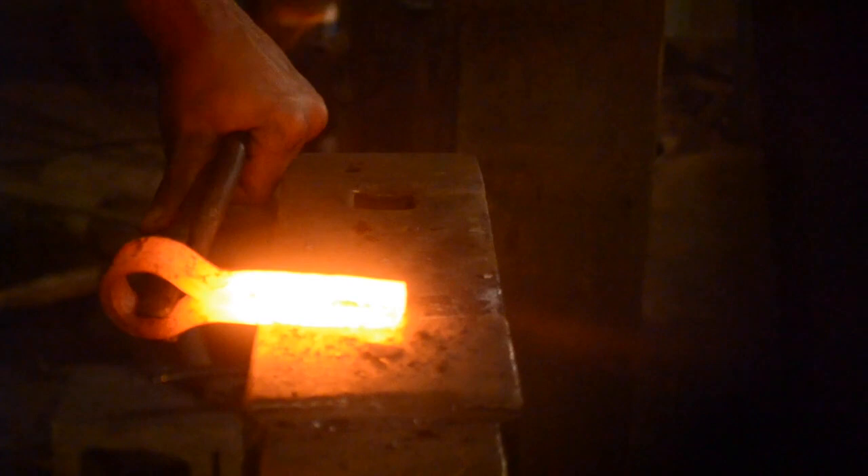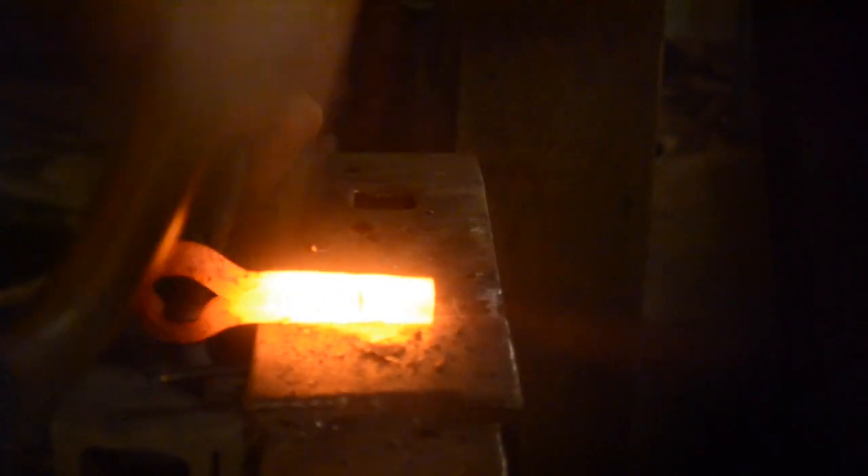Now I'm going to work down the bit into the appropriate shape. Unfortunately I overheated the piece here — this type of spark means the metal is burning. It's not the end of the world but it means your surface isn't going to be quite so nice. I'm forging down the bit at a welding heat. You can improve a successful weld past three heats even if you can't repair a failed weld. You want the hammer to strike diagonally so that the bit gets smeared and elongated — sort of pull with the hammer on one face and push with the hammer on the other face. One of the characteristics of blacksmithing is that you will get burned. Even if you're wearing gloves you still might get burned — the worst burn I ever had was when a glob of liquid borax fell down the back of my glove and I couldn't get it out. I don't bother with gloves anymore; I could use the extra dexterity anyway. A quenching bucket plays a dual purpose after all.